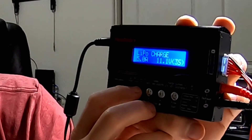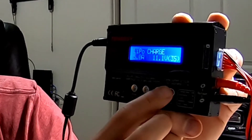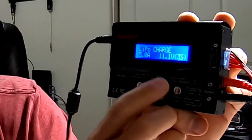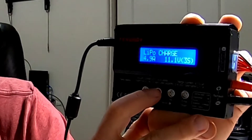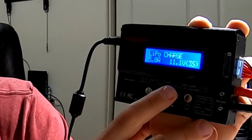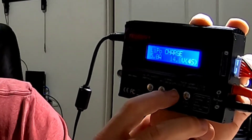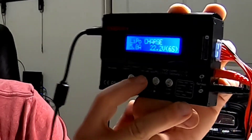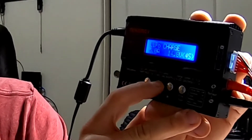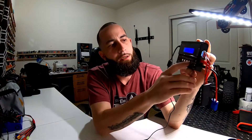What you're gonna do is pick the mode — LiPo — push start, then push start again. It will start flashing through the amps, and you go up or down. If it's lower you can go down, push start again, then go over to the voltage. It goes all the way up to 22.2 volts — I'm gonna put mine back down to 11.1 — and it's pretty much that easy.